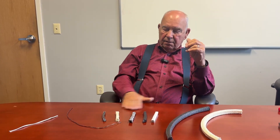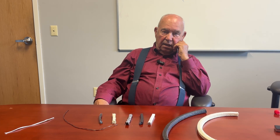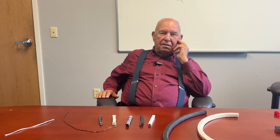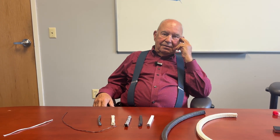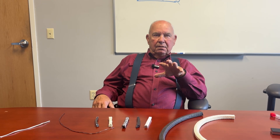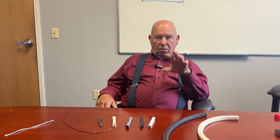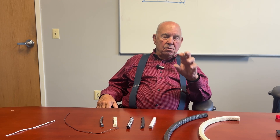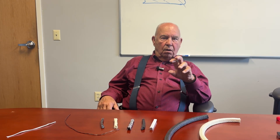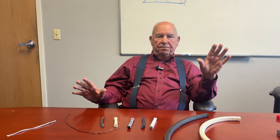What we have to keep in mind is that packing is a multifunction product. It isn't about just finding the cheapest price anymore — those were the days of single-A, double-A, triple-A, and four-A asbestos with either graphite or Teflon; that was the entire menu. Today there are many choices available. To make the proper choices — which will be the subject of another Pump Seal Channel video — how do you determine what's best for your specific need? You should be able to specify what you want, analyze what is capable of sealing hydraulically and what is not, understand where friction will come into play, and therefore what materials and braid type to select.